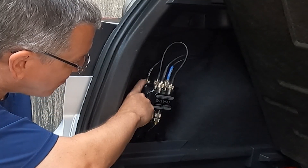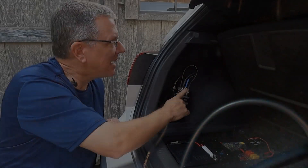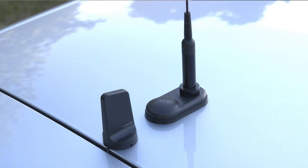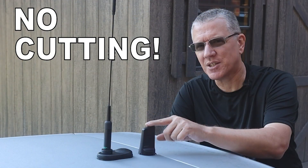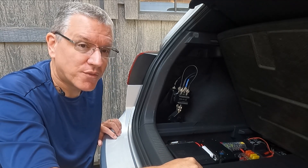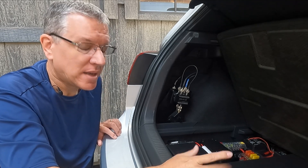The recombined signal exits the second CF-4160, loops under the plank, and goes to the VHF/UHF port of the CF-706A I mentioned earlier. The CF-706A combines the VHF/UHF outputs with the six meter output from the FT-857D. The final output goes through the light bulb access flap in the car's trim, up through the C-pillar, and exits through the roof of the car as a single port. I have a separate video about that.